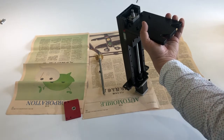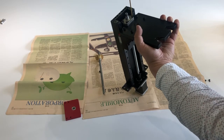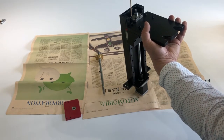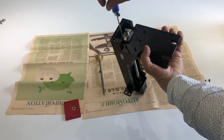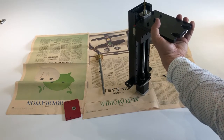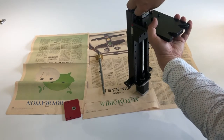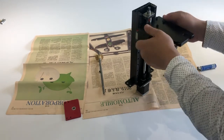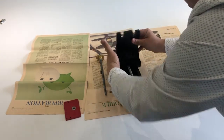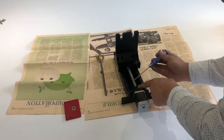Take off the bolts — the locking bolts for the platform locker. The second one, the third one — two to four. Be a little bit careful for the first one because it's locking. After you take off this one, your platform will be free and can move very evenly. Then loosen the top locking bolt for the ball screw here.